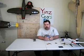Now, I've said C a whole bunch of times, and if you don't know what I'm talking about, C is an output multiplier, basically. So if your battery is rated at 2200 milliamps, divide that by 1,000, you'll get 2.2 amps. Well, if you multiply that by 30, you're going to get the total output of your battery. And that's going to tell you what your battery is capable of doing. If you push it past that, that's when batteries get hot, and that's when they puff up, and that is bad for your LiPo.